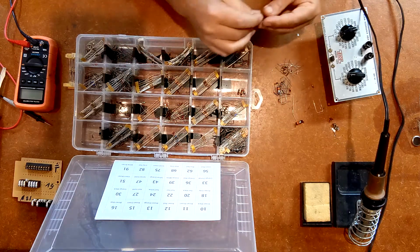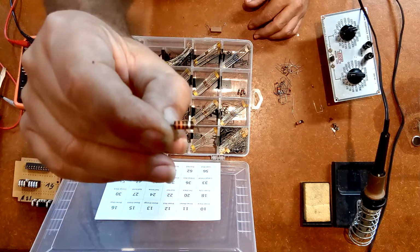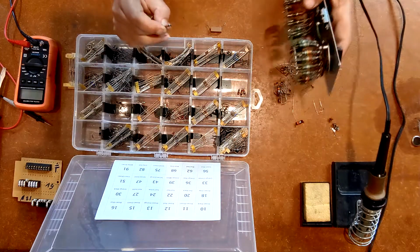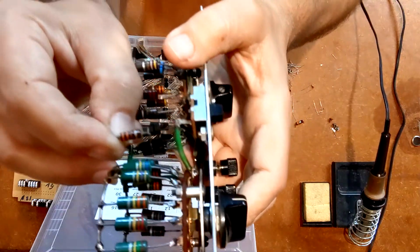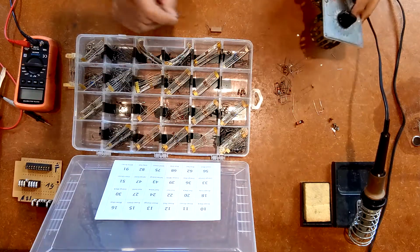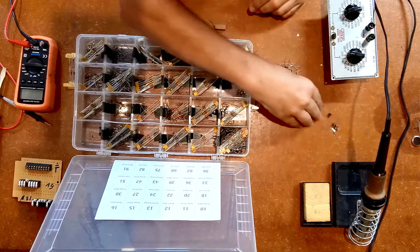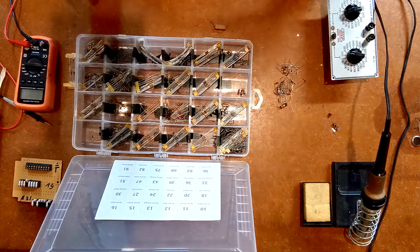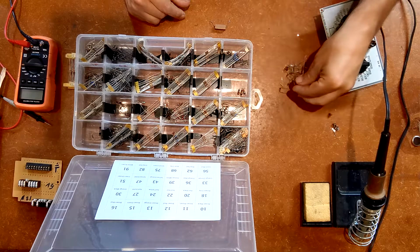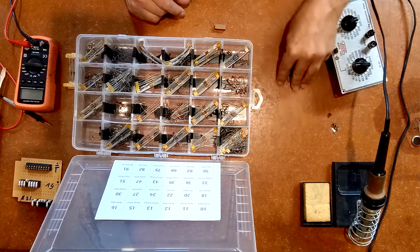And I would guess that these resistors that I harvested off of something are, sorry, I'm out of focus there. These are probably 1/2 watt. But if you compare that 1/2 watt to the resistors on this device here, I think those are 1 watt resistors. I am not going to try and push my luck beyond a watt when I use this. Generally, it's all low power stuff that I'm doing, so it doesn't really matter if they were all 1/4 watt, I'd be good. But if I've got a big enough resistor, I might as well actually use it and put it in here.